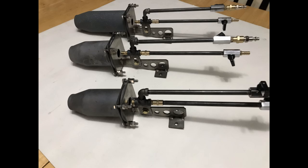It costs a lot more, but we're not really paying attention to that now. What these burners do is induce something called a high-velocity flame. A high-velocity flame is often used in kilns where flame impingement is unacceptable. Basically like a 60,000-watt hairdryer — they blow out extremely hot air in very large volumes. The velocity of the flame exiting the nozzle is about 50 times higher than your average burner.